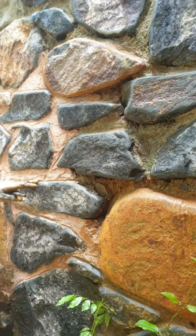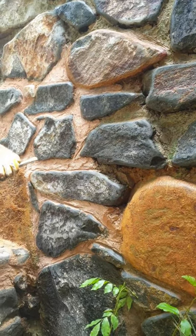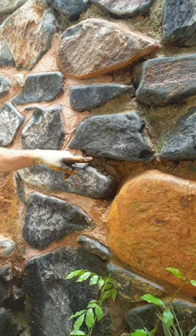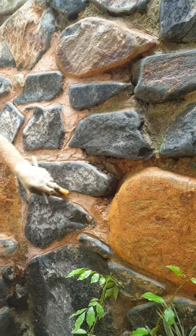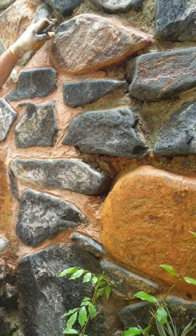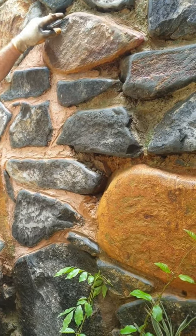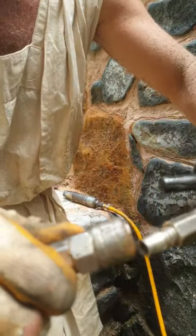Here is an example of a wall which is already plastered in the way we would like it to be in the end. This is a lime mortar with a mixture of red brick powder, and here is still the ugly gray Portland cement which we don't want to see. This is already deep enough — I wouldn't have to dig much more. You can see that all the edges of the stones have been polished to make them look nicer. On top we have some critical areas which I will clean right now, to show how efficient the tool is. You don't damage the stones and you don't ruin the mortar even if you work very close to finished areas.